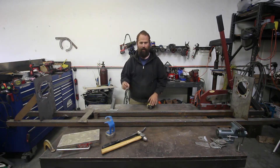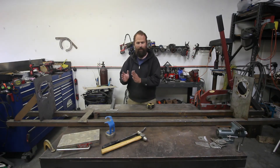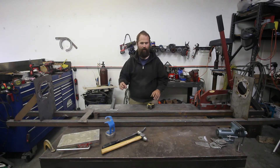That was a good benefit of this custom front end. Also, if you extend Dana 44 TTBs, you'll just have to form some pieces of 3/16 plate that match the dimensions of the beam tube. If you want four inches of extension, you just make it four inches, chop it, extend it, and weld it. I have a truss that goes over that so it doesn't create a weak point.